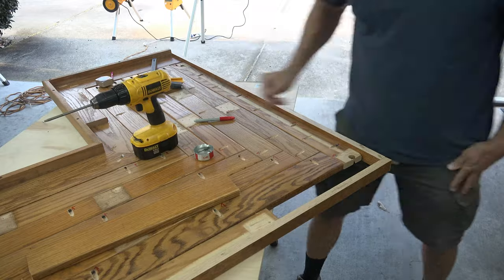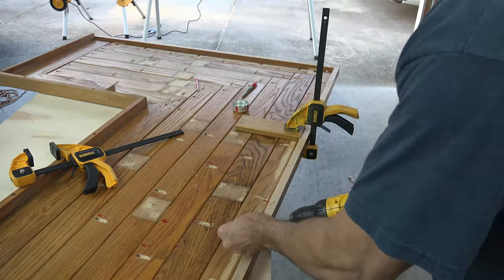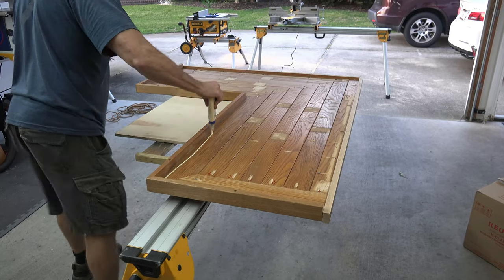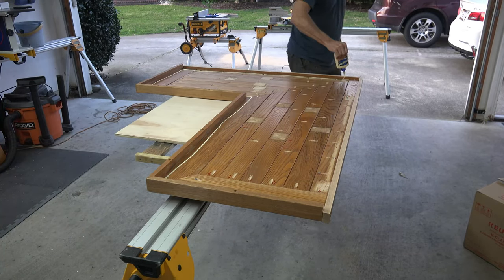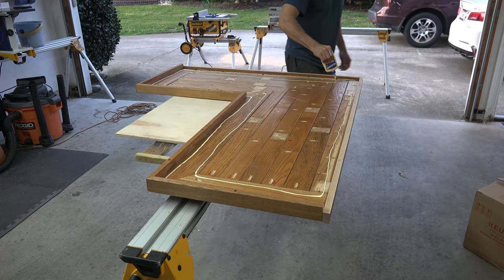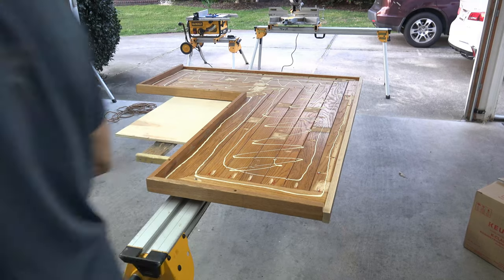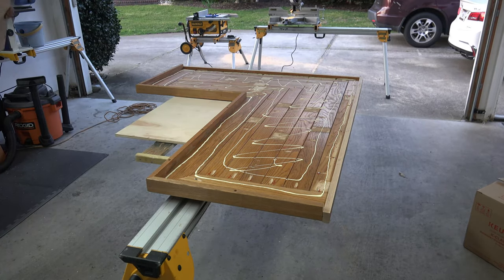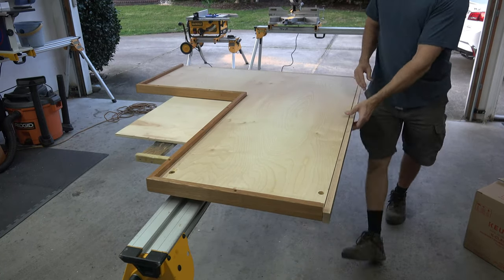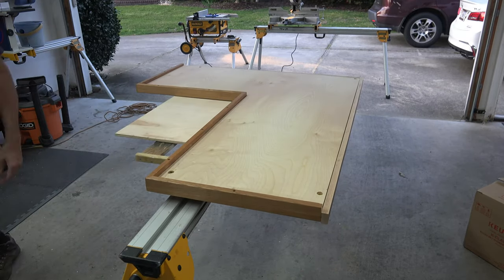This is when I realized that I probably didn't need the ply sheet underneath the top of the desk. But oh well, the ply sheet made tying everything together much easier in the long run. I did want to let you know, before I decided to do it this way, I realized that each piece of wood I was going to use had a slight bevel to it. So if I decided to make this one big smooth surface, I would have to cut away each beveled edge, and I am almost sure I would not have had enough wood for that. So my solution was to just join them all together and place a piece of plexiglass over the top of the desk. This would allow my son to write on paper without his pencil taking a dive through the paper if he hit a groove.